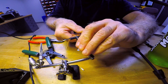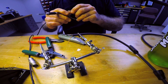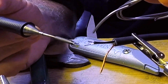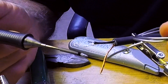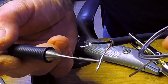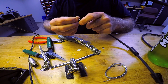Keep your cable steady — I like this little alligator clip gizmo; it holds everything in place. Get your solder and tin the wire so the strands all stay together and aren't fraying. Basically just hold all the strands together with the solder. Sometimes I'll flick it a little bit to get excess off, but be careful not to get it in your face or eyes.